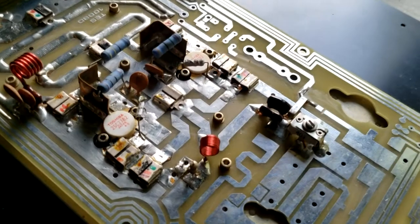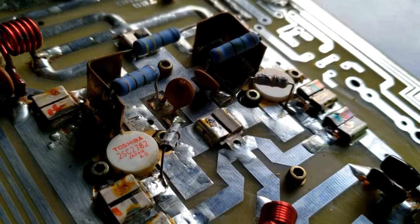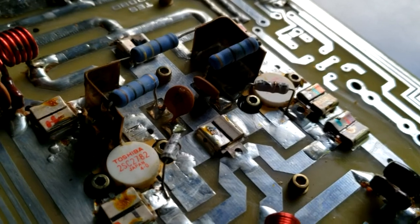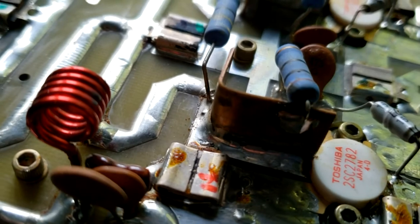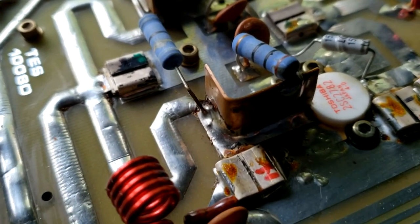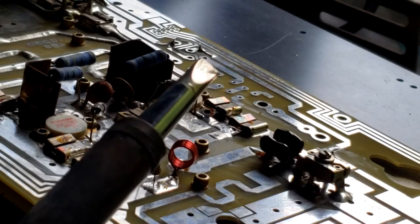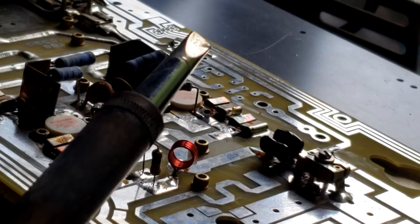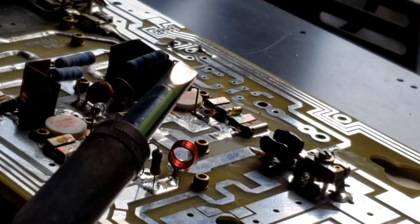Here are the two transistors that we're going to have to remove. We're going to remove some of the resistors and coils, and also the two copper heat sinks that are on the collector circuit of the transistor. These will probably be the hardest thing to remove. I'm going to make do with a 100-watt soldering iron with what we call a screwdriver tip. This tip is approximately the width of the circuit strips in the RF circuit.